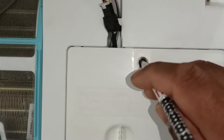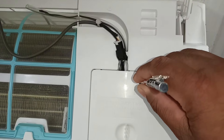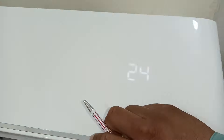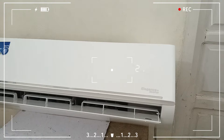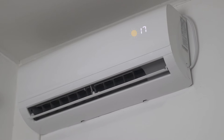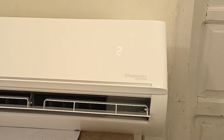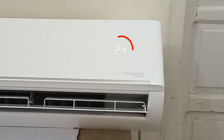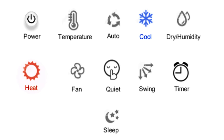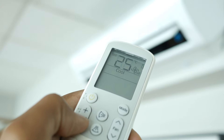Note that you will only have to press the button once. After pressing the button, the unit display shows 24 degrees. The weather is cold right now, so the air conditioner will work in heat mode if it has one, making the room warmer to 24 degrees. This is a forced auto mode — it will detect the temperature and work in heat or cool mode accordingly. It is a fixed function; you cannot change its program. If you want to change the program, you will need a remote.